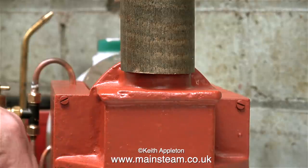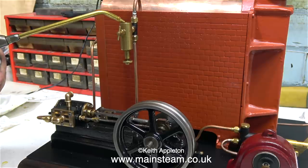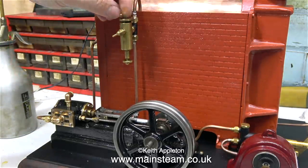I notice already that the sides of the boiler are getting very hot indeed. Now it's time to fill the displacement lubricator with steam oil. In this clip I notice that the top part of the boiler casing is starting to blister slightly. I did expect this to happen because it's very common on this design of boiler — this is the Babcock design, which is really a pot boiler with extra external water tubes underneath.